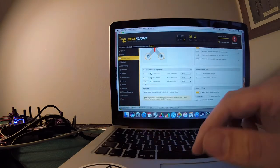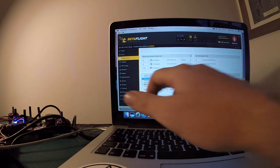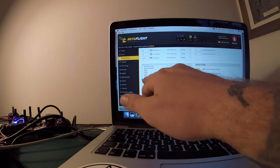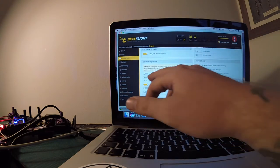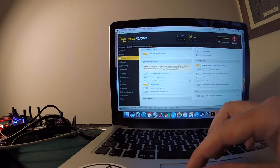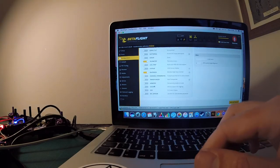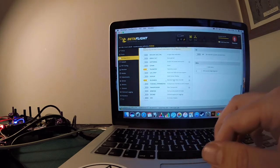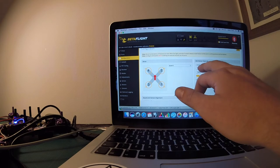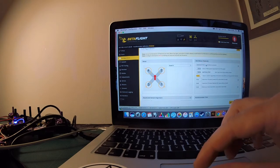In configuration, set your degrees to 270 and click save and reboot. The RX input will probably be set to PPM — we're changing it to serial-based iBus, so go to the drop menu and select iBus because it's iBus for the Wizard. For gyro update frequency, I always recommend going to four — set that to 4kHz and that will automatically set the PID loop too. On the right-hand side I prefer oneshot 125 — it'll default to multishot but oneshot is a safer option for your ESCs and motors, so set that to 125.